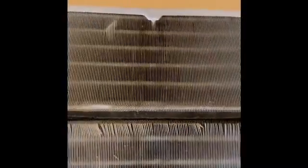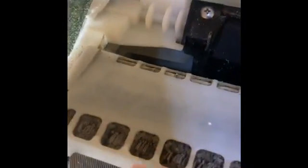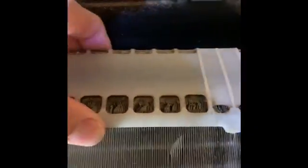It's definitely helpful. So you see here on the elements, you've got some mold kind of throughout, some other areas of mold, and then some dust and debris caught up in the elements as well. If you go up on the top here, basically looking down on it, you can see that there's lots of dust and debris inside these little holes. This piece does not come off, but you can still clean up all this dust and dirt. Even in the back here, it's kind of difficult to see, but there's all that dust back there. So all that can be cleaned up.